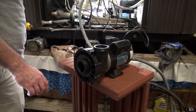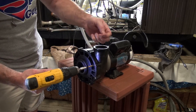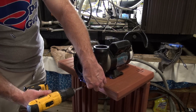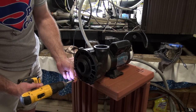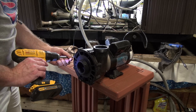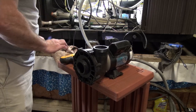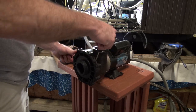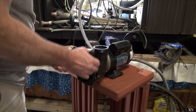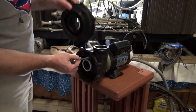What I'm going to do first is pull the face off here. This should be quick and simple — this thing doesn't look too bad. I think it's going to be relatively simple to get the impeller off, replace the seal, and just stick it right back. This got caught before it got too bad, which is an important aspect of it. If you let it go too long, it destroys the shaft of the motor and then you've got a whole different repair. Luckily these Aquaflows come apart pretty easy. There's a couple of different versions — on this particular one the seal is here, you can see it actually stayed in a groove right there.